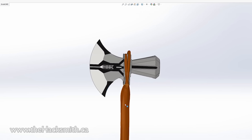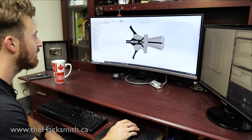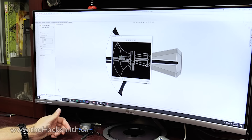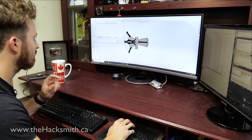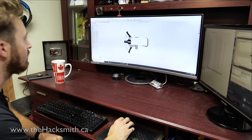First of all, we're going to get rid of the handle because we're doing the handle ourselves completely custom. So what we're going to do is look at it from the side and click export to DXF. What we'll end up with is a perfect 2D outline of the entire Stormbreaker. We're going to open up that DXF and import it as a 2D sketch. The neat thing with this is we can actually delete the stuff we don't want. We'll clean it up inside the file.